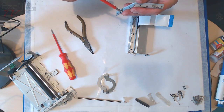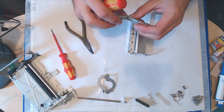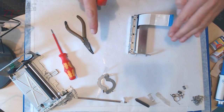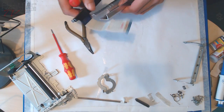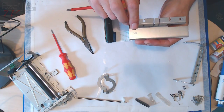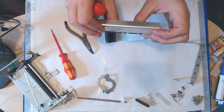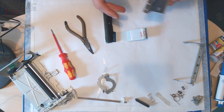What are those set screws doing in there? They must be setting the distance of this. Because it's stamped metal you can't get very tight tolerances — you get it pretty accurate but not precise. So this acts like an adjustable shim: turn it out and it pushes down slightly more, allowing you to level it. The main carriage base plate is very thick aluminium — I don't know what KPR means — but it would be handy as a heat sink.